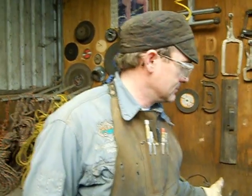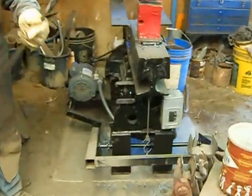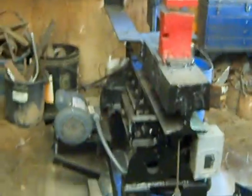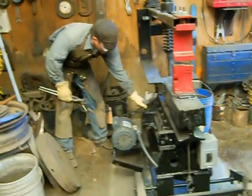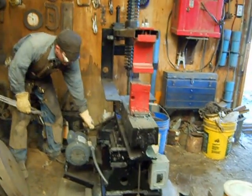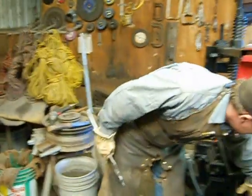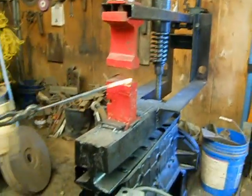The cam and actuation for the treadle is about the same as the original junkyard hammer, just a little different because the motor I was using was different. I ran this on 220 volts - I tried 110 at first and it just didn't have enough power, so I converted it over to 220. I also changed the direction of rotation. Originally it was going one way but that was grabby on the belt and I had no control, so I reversed the motor direction so it slips on the pulley, which gave me a lot more control and was easier on the engine. I made a combination die for straightening and also for drawing out.